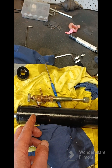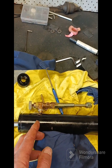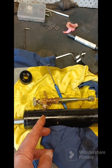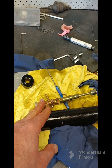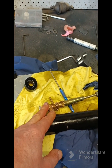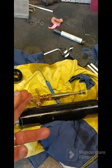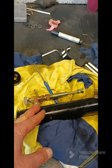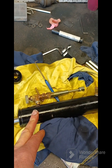Letting oil past internally inside the o-ring and then through a series of cross-drilled holes in the piston, therefore bypassing the tap. Well, it's gone the wrong way - but anyway, it is bypassing the tap. So fingers crossed that this 36mm by 3mm o-ring is the business.